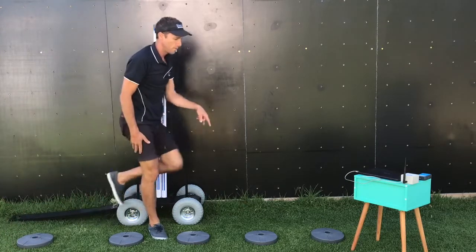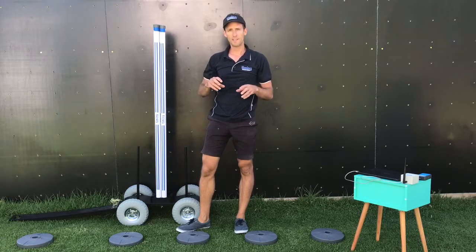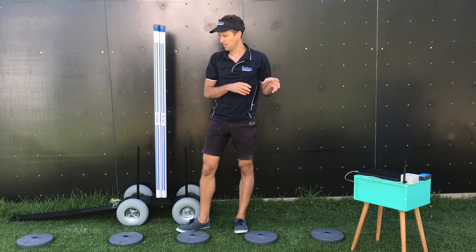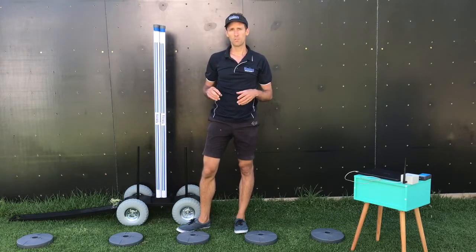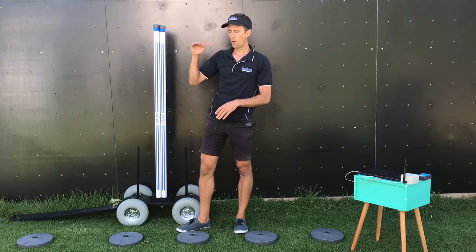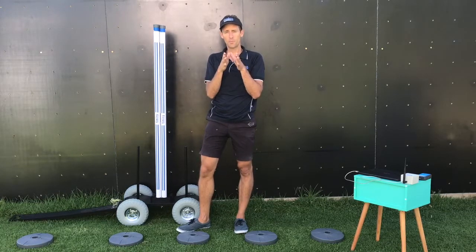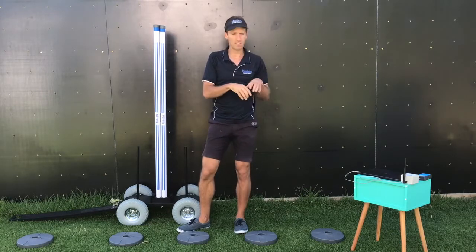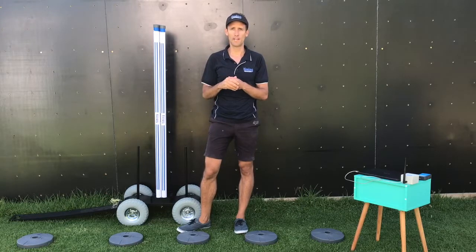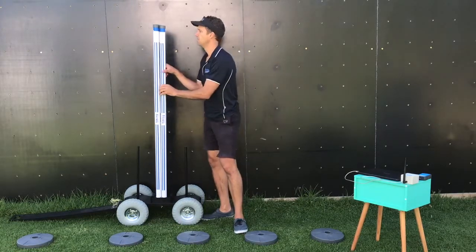Now just a note on these bases. They've got a steel plate in the bottom. They're 8 kilograms each, which means in theory they're good for around 70 km/h winds without any extra ballast being added to them. The pole's 1.6 meters tall. It's 43 millimeters wide. With that weight on a nice stable ground, it should be good for around 70 km/h. So all my arrows are now pointing across, as we discussed.